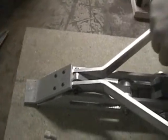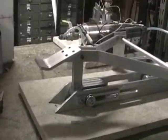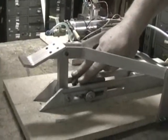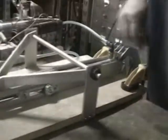And then over here, as he comes around, you can see the setup of the mechanism. We've got a two-and-a-half pound steel hammer that will drive out on the end of the piston. This is a four-and-a-half inch linkage that we're going to try, and we've also got the three-and-a-half inch linkage. The hammer will come out, hit that, push out, and extend the linkage so that the wedge goes up. When it comes back, it'll come back these three inches, and then pull, and everything will fall back down.